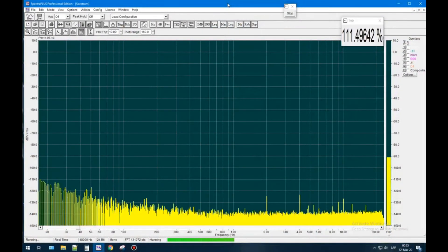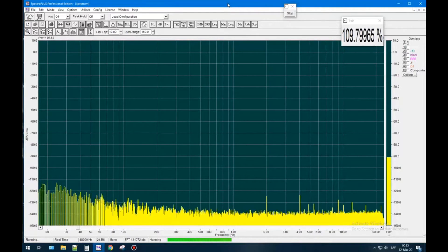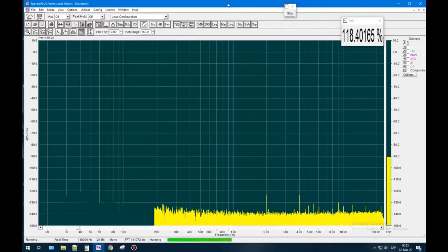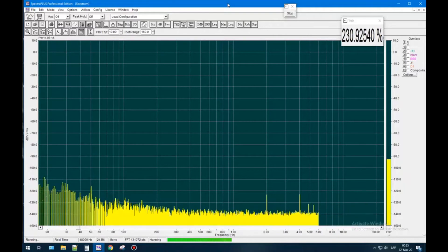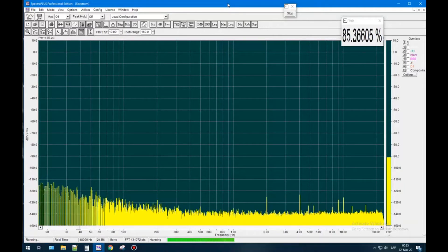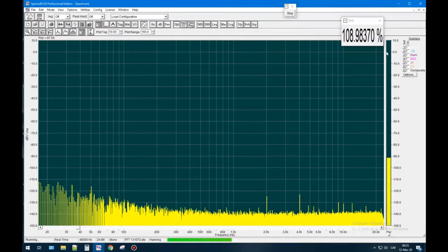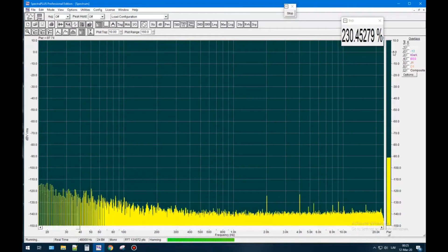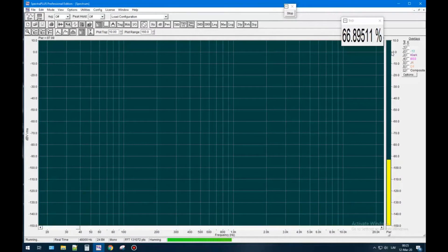As we can see on the screen at the moment, I have a sound card which is in standby mode. Here we have some sticks sticking out at 2, 4, 5, and 9 kHz on a minus 130 dB level. All scale is pretty real. We can see on the right side that 0 is analog 0, 775 mV, 0 dBu. All measurements we will make using this scale to see which types of distortion each device brings in.